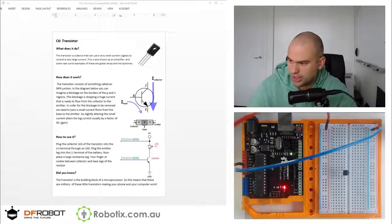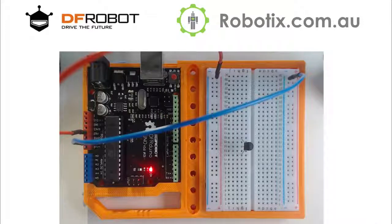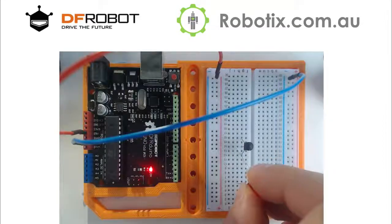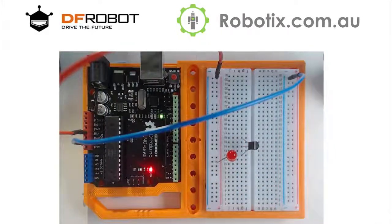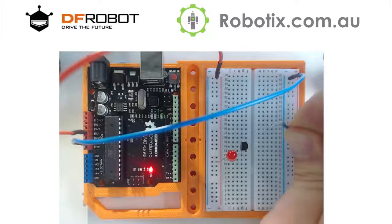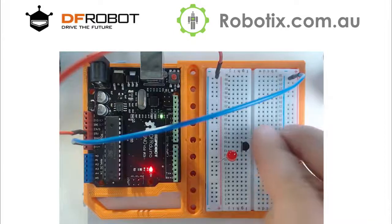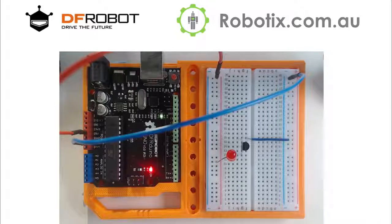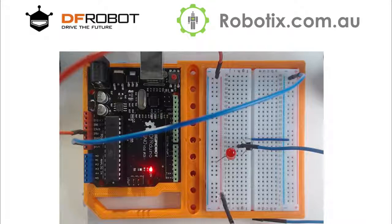So I'm going to zoom in so that you can see what I'm doing. And here we go. Red or green LED? I'll just go with red for now. So up top of that drawing was a collector from plus to right there. The minus, the emitter, is connected to the blue rail. So I think I got it. Let's see. Yep. And all we need now is the two wires. So we're going to go the blue one to the base, the white one to 5 volts.